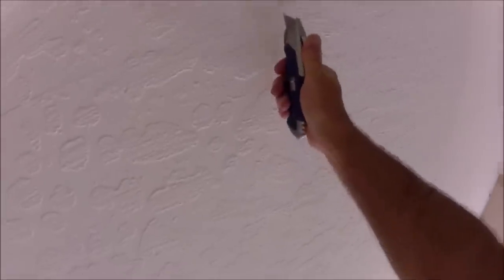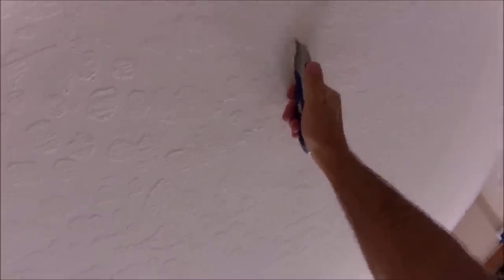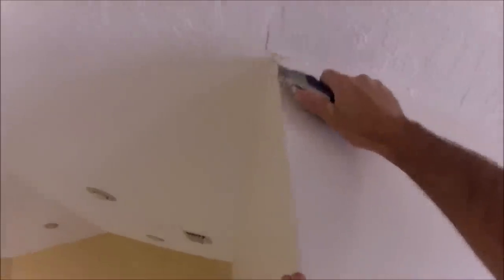I'm not sure if there are furring strips up or not. What I'm going to do is just go ahead and cut out this tape joint where it's failing. Because if you try and tape over a tape joint, especially if it has a texture, it's just going to be a hump. So you want to keep the mud confined to the tape joint after it's removed when you're doing the repair.